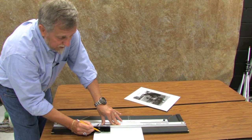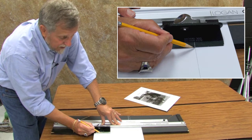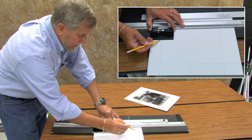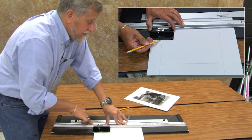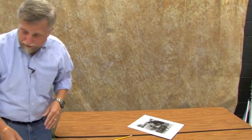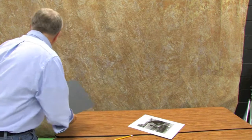And this little trick is important. There's a white line etched in the steel tool. You've got to line this line up with the line here. Then when I push this through, I'm going to stop when this line gets to this line. That's the only thing that's really tricky about this. I have to press down and make sure this doesn't move too much. The other thing that's a really good idea is to work with a piece of scrap under it. It makes a much cleaner cut. So we're going to do that right now.